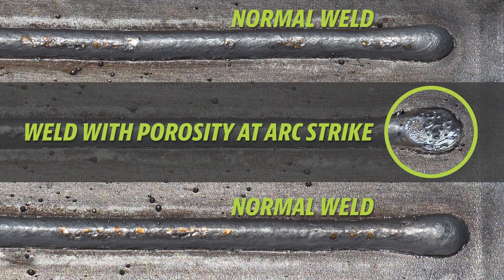In addition to saving on shielding gas, the Gas Saver also has an integrated screen to prevent gas line blockage, and it can improve weld quality by eliminating the initial burst of gas to the torch that occurs at the initial arc strike.